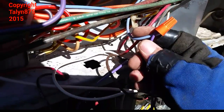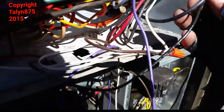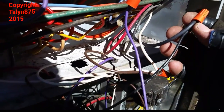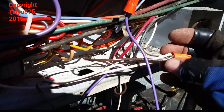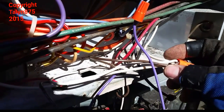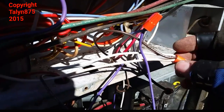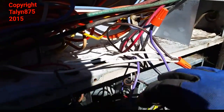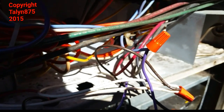We've spliced all the wires: the common going down to the heat kit, high voltage going down to the heat kit, and the W signals — W1 and W2 from the terminal strip, all jumped together. One wire was redundant, so I removed it, and one wire going to the heat strips was also redundant. The red wire I routed all the way back to the circuit board — it was long enough — to reduce the amount of wiring in the way. Next I'll check the capacitor for the blower and the compressor.